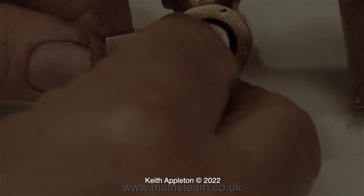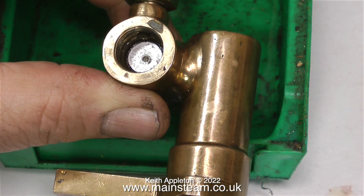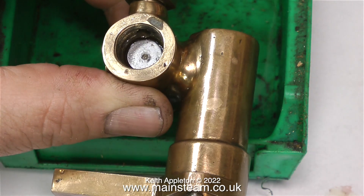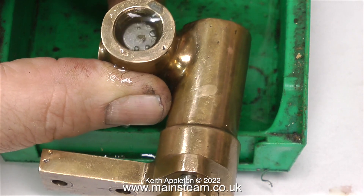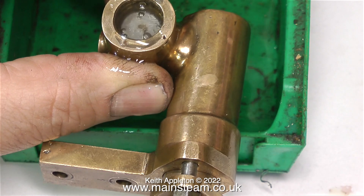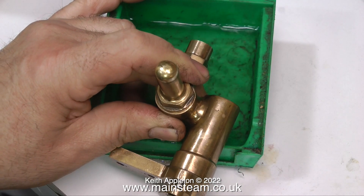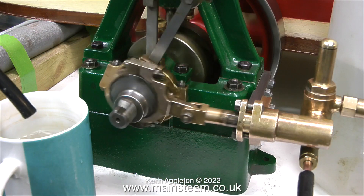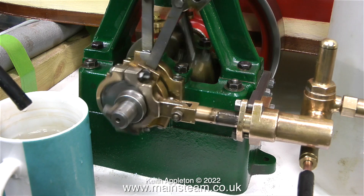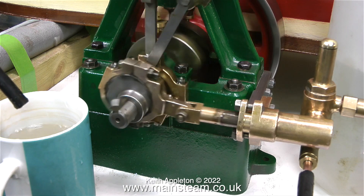This particular boiler feed pump is a Stuart 5A pump, and it has a slightly different valve at the top — it's like a poppet valve, almost like a car valve on a cylinder. As I demonstrate with the bottom part in some water, as I move the piston back and forth you will see it pumps water out of the top. You'll now look at lift pumps differently when you see them working — the little squirt coming from the pipe every time the piston moves.